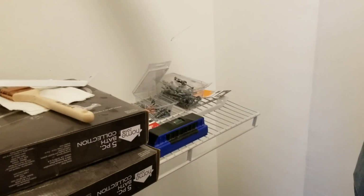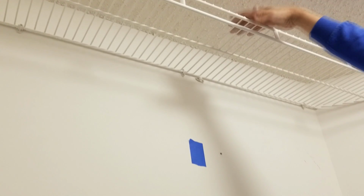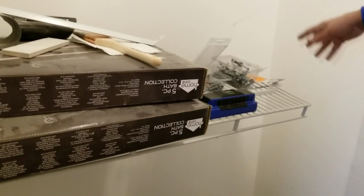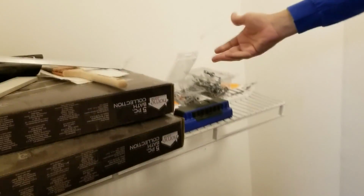And then if you look down below here too, you can see this is too close to the floor. So whoever set up this closet did not do a proper job. You're supposed to be at 40 inches on the lower one and 40 more inches higher on the upper one. So the upper shelf should always be at about 80 inches and the bottom shelf should always be at 40 inches off the floor. That's how you maximize how much clothes you can put. I doubt, maybe you can put some shirts here, but forget about anything bigger than a shirt ever hanging off this one, and then whether or not you can get shoes on the floor below the hanging clothes here. But anyway, that's why I like the Shelftrack system, because you can change the configuration of your shelves anytime you want, depending on how your wardrobe changes.